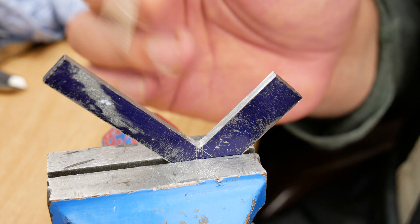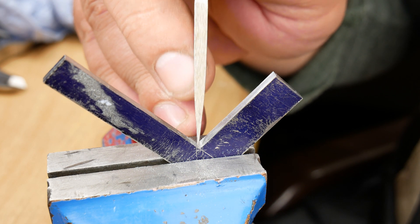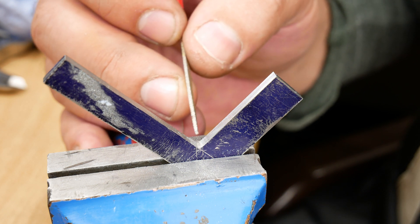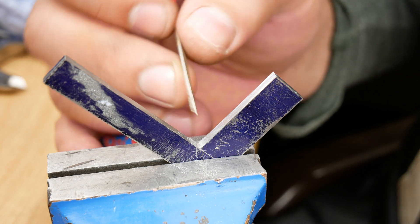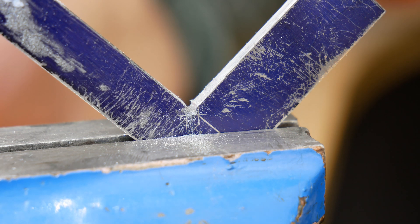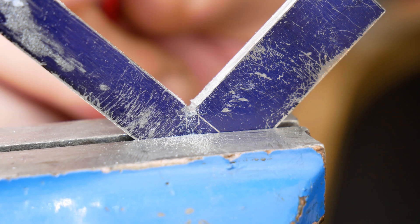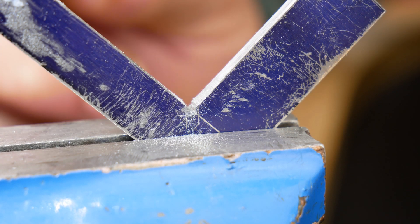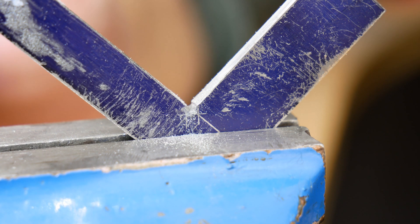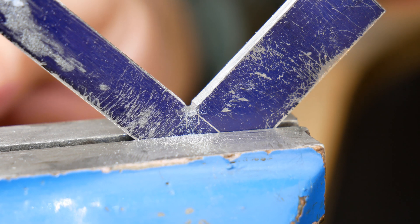At this point I've got these arms pretty close to where they need to be, and I'm moving on to cutting out this notch in the corner. Ignore this mark I've put on here — I know it's not accurate but I'm just using it as a guide to get this corner cleared out. Once I've got this corner cleared, it should make it easier to finish up each of these arms to the correct dimension. The thing I need here is a slotting file — this is taking ages and I've got nothing else that's going to keep us under the one and a half millimetre width we need. I can't break out my good files, so I'm just going to have to sit here and be patient and work through it.